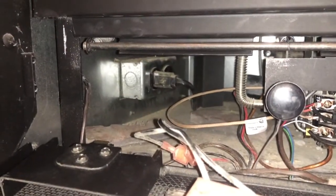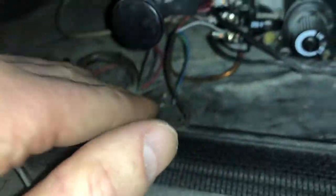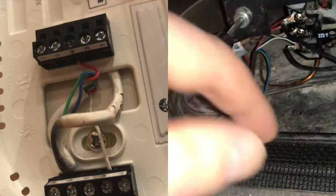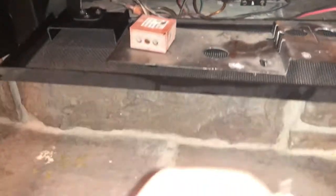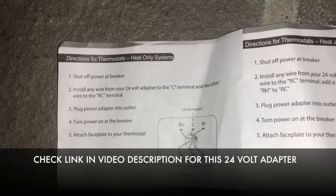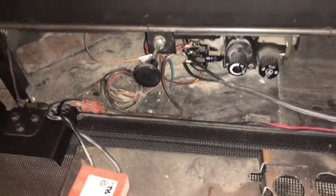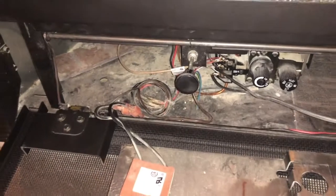I have room to get in here and plug this in on the inside. This brown cable goes to my thermostat as the red and white cable — the two-wire configuration I showed you. This blue and green wire, as you can notice, are unused — they're also unused at the thermostat. So what I'm going to do is use those unused wires, connect them to the 24 volt adapter. The instructions clearly show: install any wire from your 24 volt adapter to the C terminal and the other wire to the RC terminal. I'll splice these to the blue and green wires, which already run to the thermostat, and they're connected there to the RC and C terminals to power the unit.